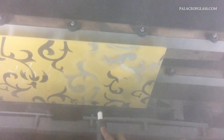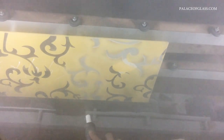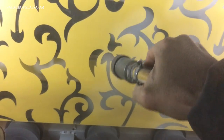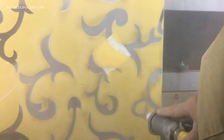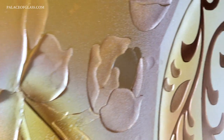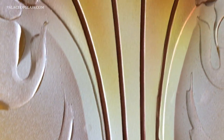Using a painting motion and overlapping areas, a uniform etch can be obtained. Some designs allow adjacent pattern areas to touch and shade different areas by having a lighter etch in some areas and a heavier etch in other areas. This technique of deep carving is difficult to master and requires a good artistic sense of black and white shading.